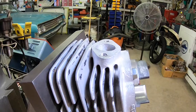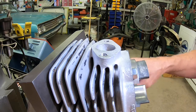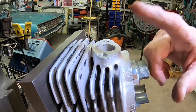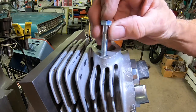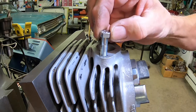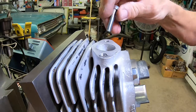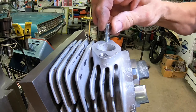I'll get you over here on the milling machine. I've got it set up in the mill on an angle plate. This angle is approximately 15 degrees, so I've got to have that set so I can get some reasonable accuracy. I've chased these threads back to 8mm, but this is what we end up with, and I believe the other one is even worse. It might hold for a little while, but it wouldn't hold for very long.